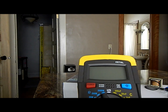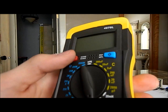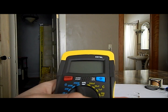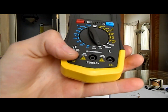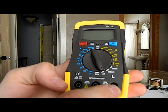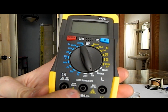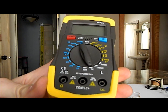There are some things I read about in the listing on eBay. It says it does have an automatic power off, so I turn it on and if I don't use it for a while it'll turn off to save my battery, unlike my voltmeter where I gotta turn the dial to turn it off. It's got three connections for the leads like a voltmeter — you got your common, but then you got inductance and capacitance over here, indicated by LC negative. Common is gonna be positive in this case. So you got resistance. Let's get to testing this.